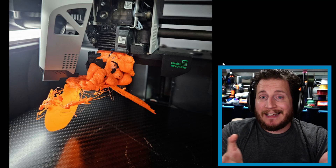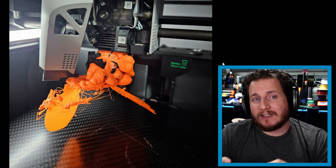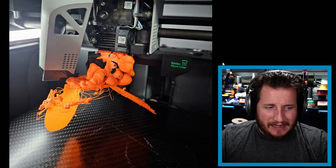While it is technically LiDAR, it's not LiDAR how most of us think of it. Their system uses a laser line and a camera to detect how that laser line is interacting with surfaces around it. If the surface is reflective, it can't detect it very well and will often give a bad reading, resulting in a poor first layer. This is something we see way more often than not when shiny build plates are used on X1 Carbons with first layer scanning and LiDAR activated. You get comfortable with your machine, trust it to do its job, and as soon as you trust it — it decides to do its own thing.